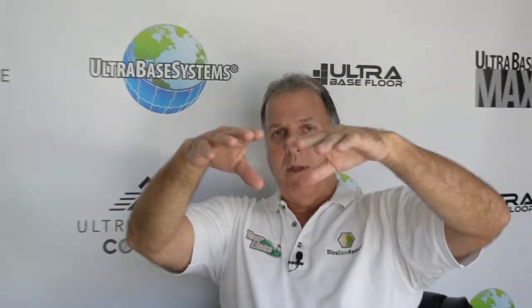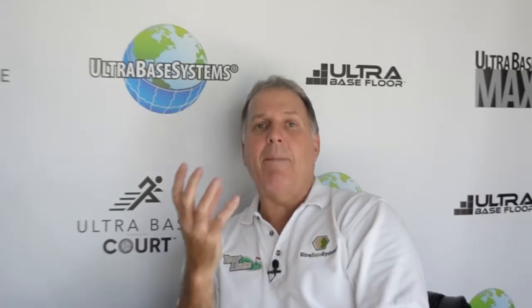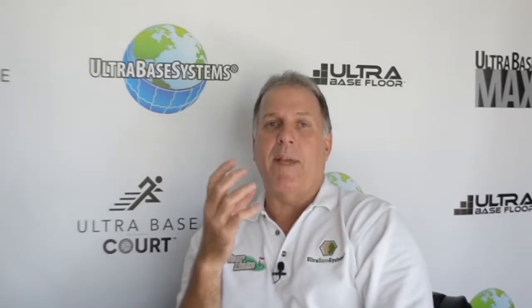And what happened was that the rain comes down, hits the panel, runs through the panel, hits the liner, out under the liner, and down into the perimeter drain systems. And we are building on expansive clay soil, and we added no stone to that base. Didn't need to. Why? Because we capped it, we isolated it. We basically removed the possibility of water getting to it to turn it into mud. A geologist told me a long time ago, clay and water equals mud. Get rid of the water, and clay is a great thing to build on. So there's all kinds of opportunities here for all of us.